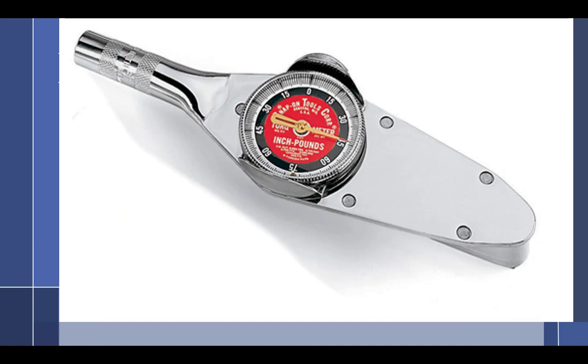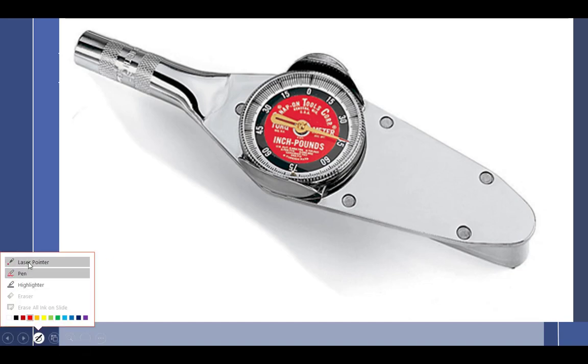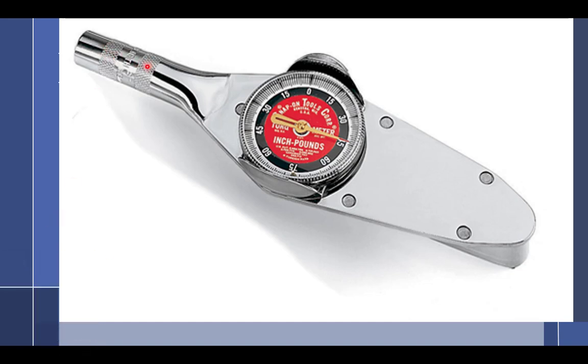When you're using these, notice that this is called knurling over here. This is the effective range of the torque wrench right here. So you should be grabbing it centered over this area right here. Nice, gentle, steady pulls. Try not to start and stop, it changes the torque value. So also work with the helpers over on the torque wrench thing, and experiment. Please experiment. That's what it's there for. See what it looks like. Feel it. Notice how off the torque wrenches can be.